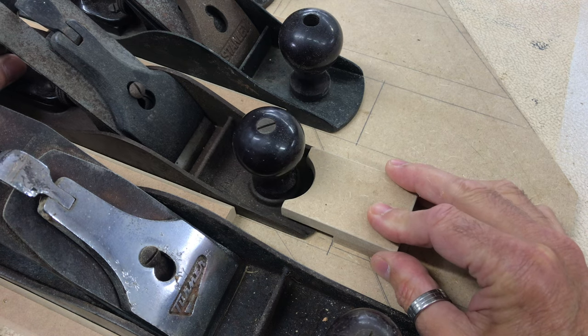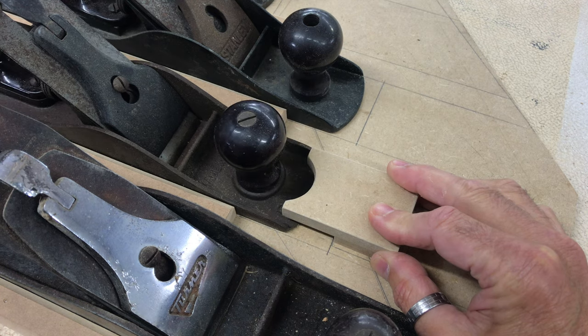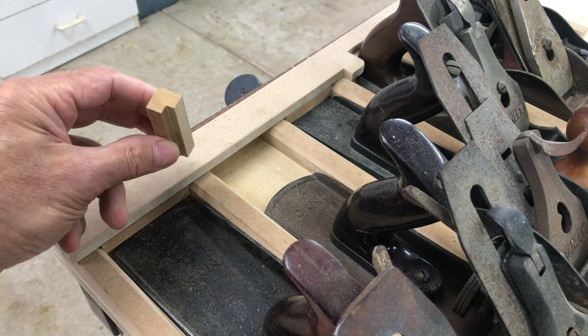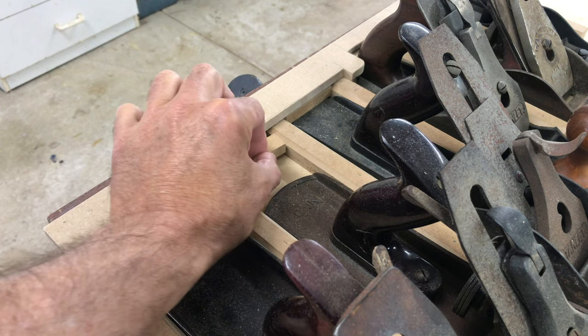While I was working out the position for the toe brackets, I realised that I didn't need the bottom holder to be so deep. I only needed a few millimetres of the heel to sit in that holder, so I made these little infill pieces which made the planes sit further up under the toe brackets.